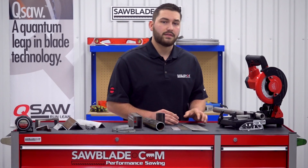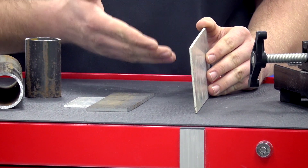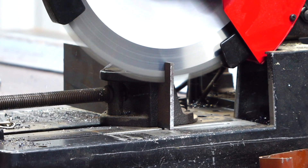Finally, when cutting with flat stock or plate, it is best to position the material vertically, if the cutting capacity of the machine allows.